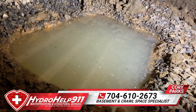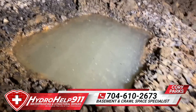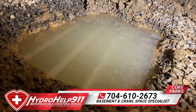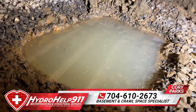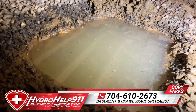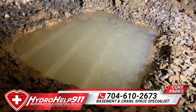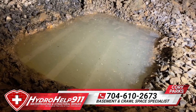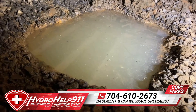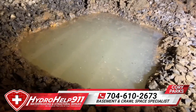This is not water coming in from the outside. This is strictly the water table under the ground in this area rising and pushing water up. There are a lot of companies out there that will try to fix water issues on the outside, but if you're dealing with a true professional company, most of the time they're going to recommend doing an interior drainage system. And this is why — because an interior drainage system will manage the water that comes in through the walls as well as water that pushes up due to hydrostatic pressure.